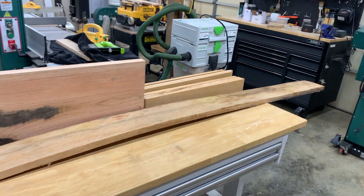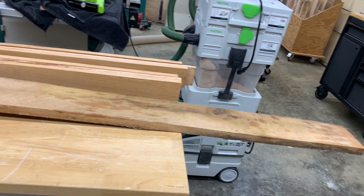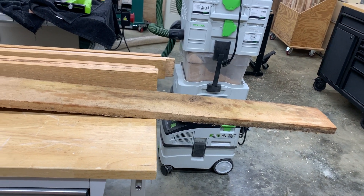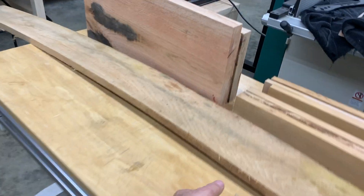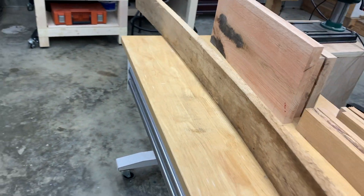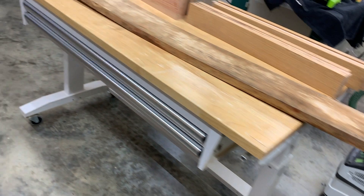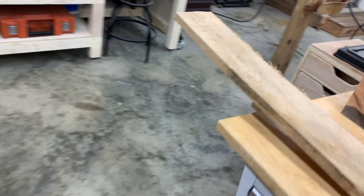Check out that board. I went out to the barn looking for wood — most of the pieces I need at final length are going to be three and a half and five inch panels for the sides of these planters, needing to be 15 inches long. You look at a board like that and think, what a piece of crap. This was probably the curviest one I had in the stack, but it's not scrap. You can take this board with this horrific bow in it and cut it down into 16-inch lengths, and you won't see that bow — it'll be gone.